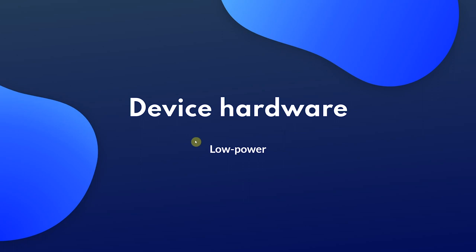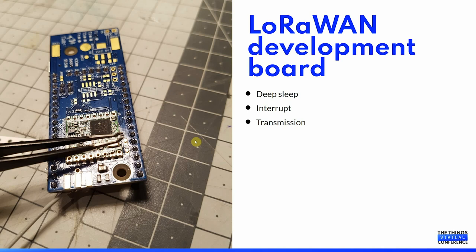Next, we will look at some very important hardware considerations. To be able to achieve long battery life, the device will have to be in deep sleep mode as much as possible. Therefore, I had to choose a LoRaWAN development board that had the lowest possible current consumption during deep sleep. Also, it would have to have the capability of defining the type of interrupt that would wake it from deep sleep when needed. Finally, the current consumption during transmission would have to be at the lowest possible level.